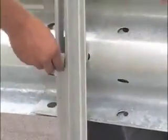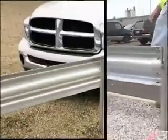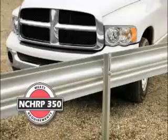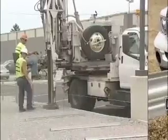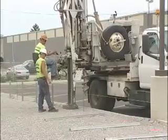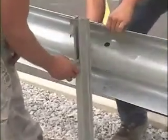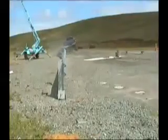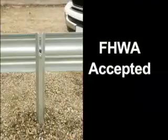Protecting lives and protecting highway budgets — the New Guard 31 W-beam guardrail system is revolutionizing highway safety. It complies with standards for both NCHRP 350 TL-3 and TL-4 and the MASH standards for TL-3 protection. The system uses specially designed rib-back U-channel steel posts with a slot that allows a standard W-beam guardrail to rise with the vehicle during impact, dissipating energy in an innovative way that results in a smoother, more predictable vehicle redirection.